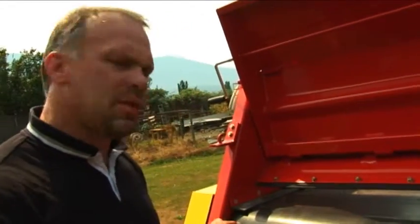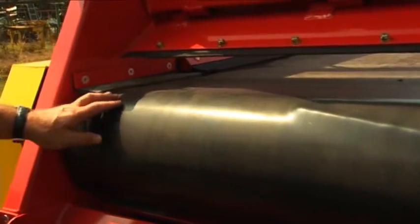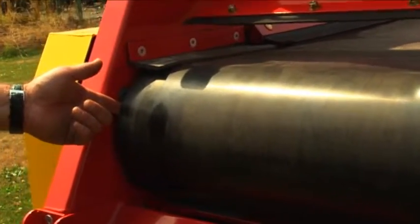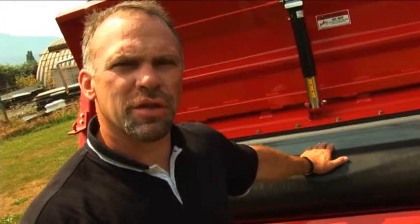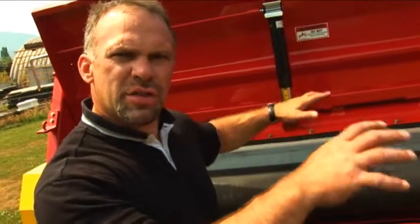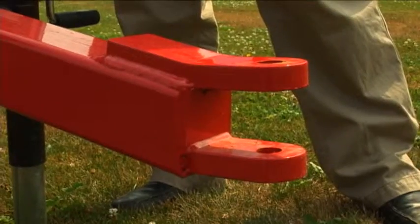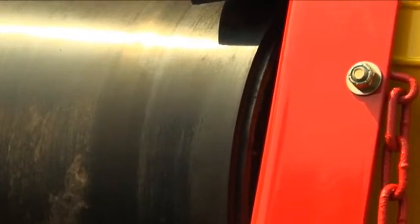We use a six-foot wide, seamless conveyor floor that is three-eighths of an inch thick with two corded plies. Its durability is unmatched anywhere in the industry. The smooth conveyor floor eliminates load shift — the load stays even and drops evenly, which allows for a consistent tongue weight and makes it far easier to tow. Once the break-in period is over, your belt will self-track and you'll never touch it again.